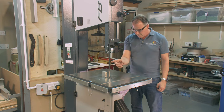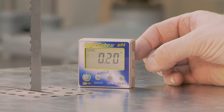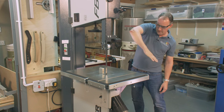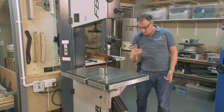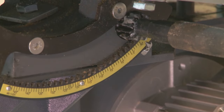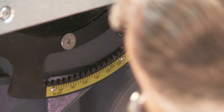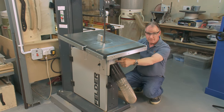I need to make sure that the angle cube is sitting at 90 degrees to the blade, not spun around the other way — otherwise it's only telling me what it's doing in one plane, not the other. This band saw can tilt 45 degrees one direction and about minus 10 the other. At the moment it's going down to almost minus 11 and a half degrees, or I can bring it right over. I need to make sure the guard at the front is in a lower position, otherwise I would bend that guard.